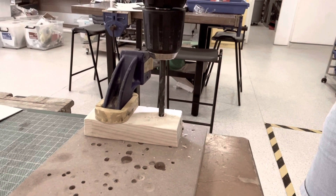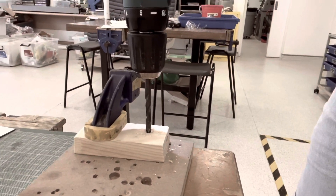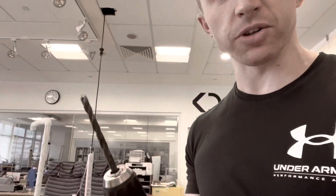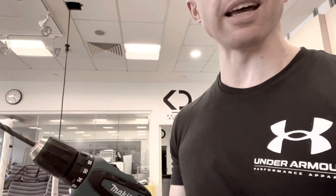What you don't do is stop and then try to wiggle the drill bit out. You keep pulling the trigger until it's completely released. Now, the drill bits get very hot when you're working with them — same with the pillar drill — so it's important that you don't touch the drill bit until you give it at least 10 minutes to cool down.